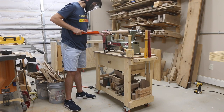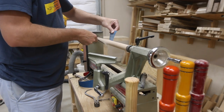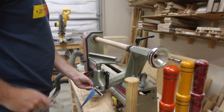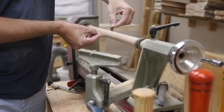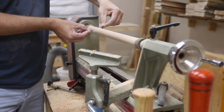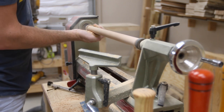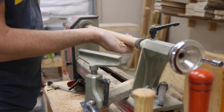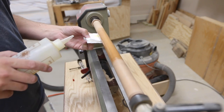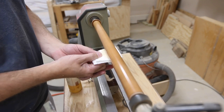Next up was the handle. I cut off the harsh corners from what you saw me glue up earlier so it would be easier to get into round. The basic process is get it into round, use a rougher to get it into the general size you need, and then measure often with some calipers to make sure you're sizing it properly. Then I just sanded it with 80 grit, 150 grit, and 350 grit. A trick you can use is a handful of shavings once you get it quite smooth — rub these on the piece while it's spinning and it will really burnish it and give it a nice look. Then I added a bit of Mahoney's walnut oil and buffed it on high speed with a paper towel.